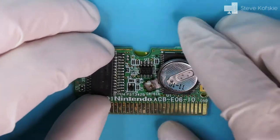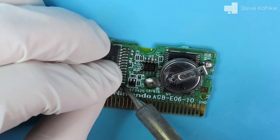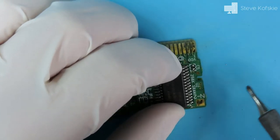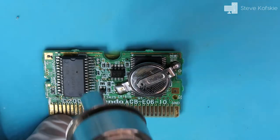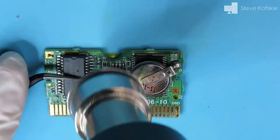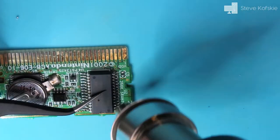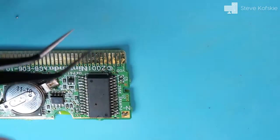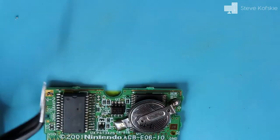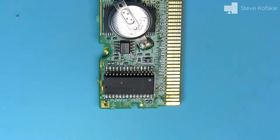When I was getting ready to seat the chip with the hot air station, I thought I could get away with heating the top and bottom pins with my iron to make the chip stay in place. I learned that was a no-go with the chip getting lopsided. I reversed that and went back to heating up the area and positioning it with my tweezers. To make sure the chip legs were secure, I ran my iron over both sides.